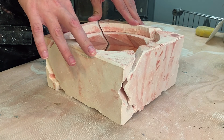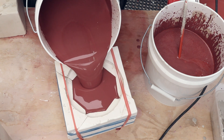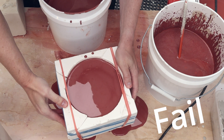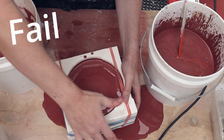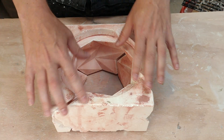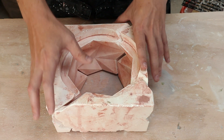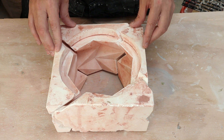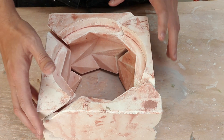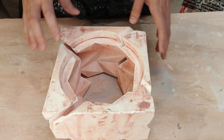I went to go and cast another pot. I didn't have a good seal between all the different mold pieces and I had a big mess to clean up. I thought my mold was good enough, even though it was leaking a little bit, but clearly that wasn't the case. I knew my faces weren't meeting properly. If I push a couple of sides together that are tight, I wind up with a gap on one side, so it's not square for some reason.